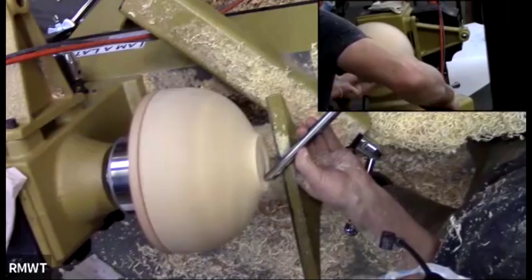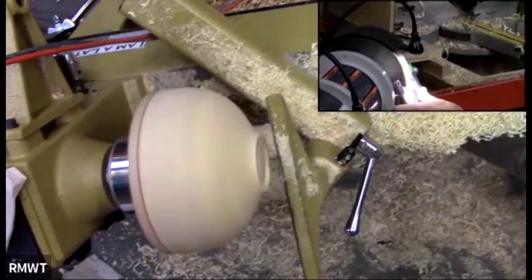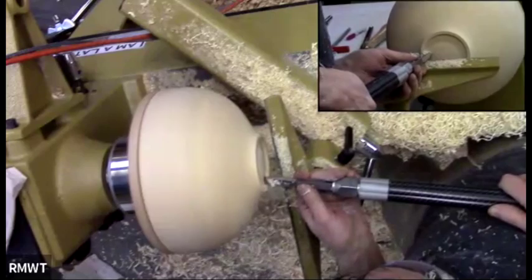Then we'll cut in one this way. Then we'll just do a quick negative rake in two places. So what I'm gonna do with negative rake, I'm gonna put the burr back on this guy. So it's just a square beading and parting tool. Let's use it in the bottom where the gouge didn't like to get in that corner too much. And just got a few tool marks there. So just glancing across the bottom. It's just a burr on here that I'm relying on the burr only. If the burr wears off before I get it finished, then I'll put another burr on it.